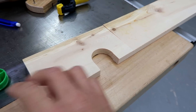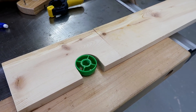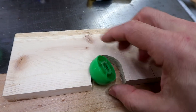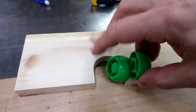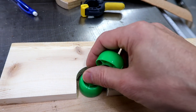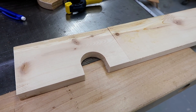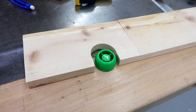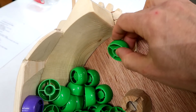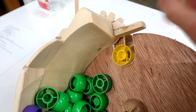If the disc had deeper slots, a cap could fit in it like this, or like this, and then I wouldn't have this problem of needing the caps to be in the right orientation. But the problem is, with a slot like that, the caps could also get jammed on the edge, or two caps could get in there sideways. And the problem with that is, sure, it'll bring the caps up, but then they'll jam downstream. So I wanted to make sure all the caps came up in this orientation only. I even sanded the edges of this disc here so that if the cap is in there backwards, it's more likely to slide out. Although it turns out, every once in a while, a cap still does make it up there the wrong way.